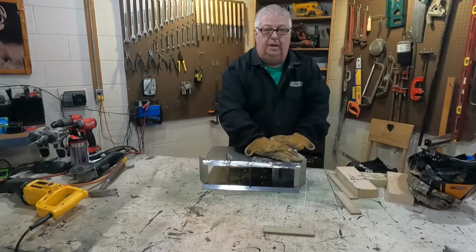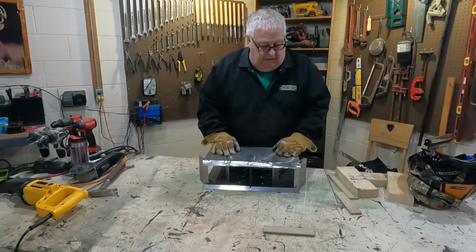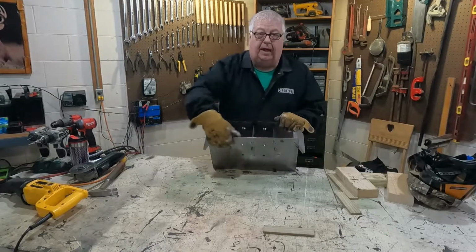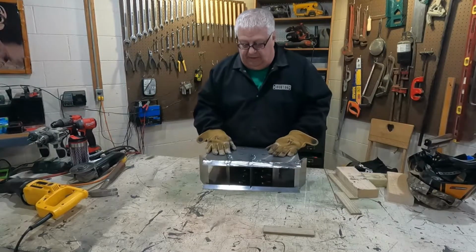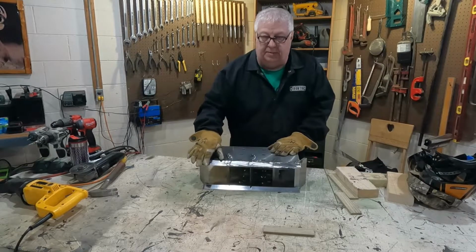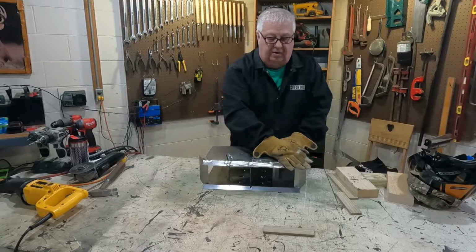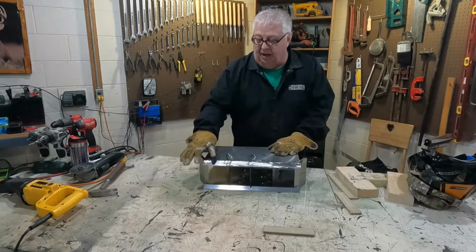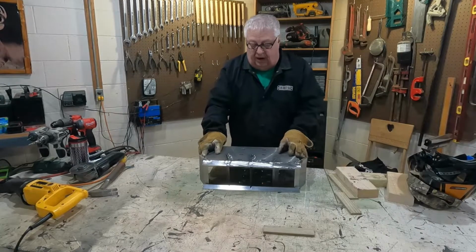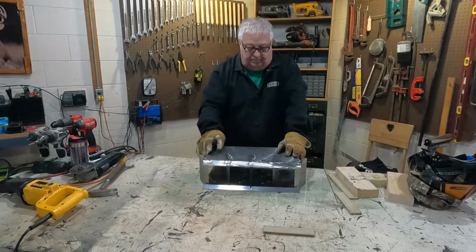So I got this all welded up. I gotta take this and do the bottom side yet and weld that, but I don't need that on camera. What I'm thinking of doing here is this front edge seems to be damaging real easy, getting dinged up. So I'm thinking about looking for some hard facing rod, and maybe I'll weld that up 1/4 inch or so on the front there, just to get that good and hard. And I think that's going to be it.